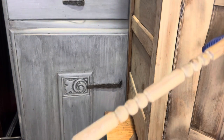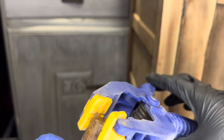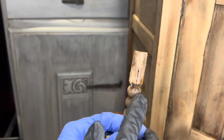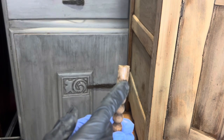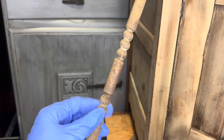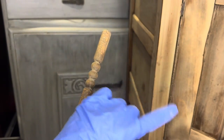As you can see, I have removed the trim pieces, and then this one had a split in it so I went ahead and glued that one up — it should be ready to go. It has been split for a long time; there's a big gap there that we can fill in. They had used three nails — one in the center, one over here, and one over here — so we'll fill in the two side nail holes and just use the single nail when we reattach. On this one here I've added a little bleach just to see what it does to this wood, because I'm going to get ready to sand all of that.